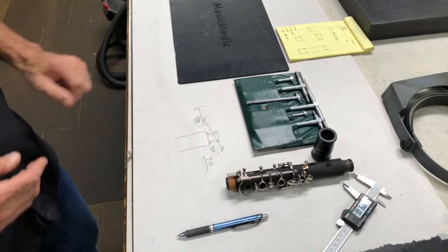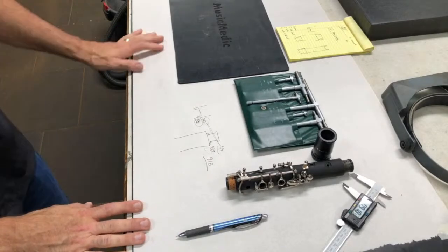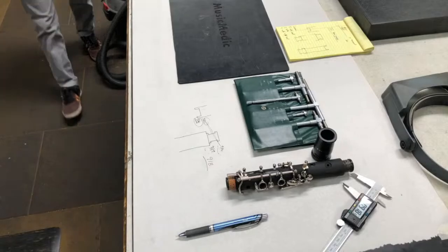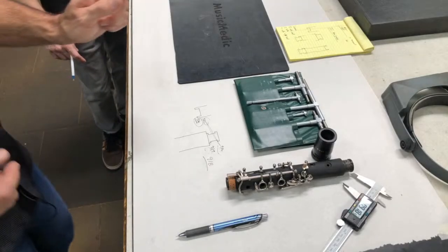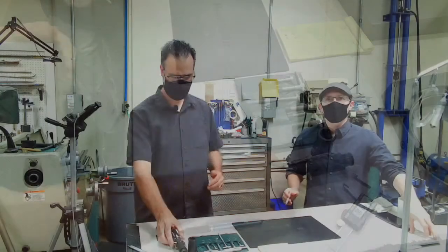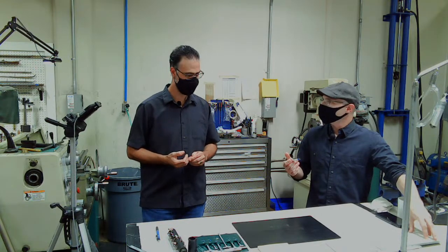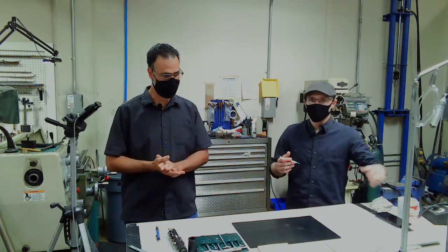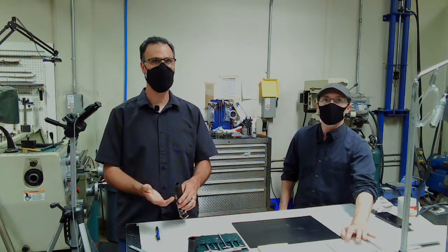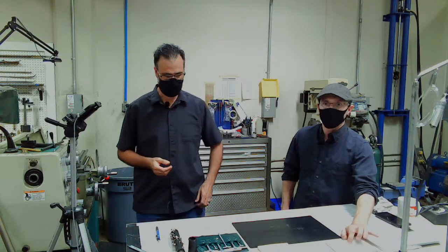What kind of cutting tool are you using? It's just a flat cutter — a parting blade. It works great, it's nice and flat and it gets right up against that shoulder and gives a nice clean cut. Is this also a procedure you can do on oboe? Absolutely — it's basically the identical thing, just the diameter you're working with is smaller because the bore of an oboe is smaller than a clarinet. Exact same procedure, no difference.